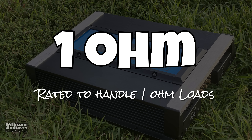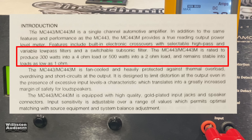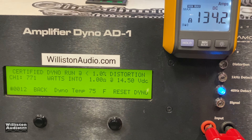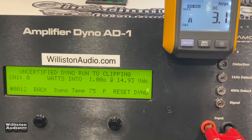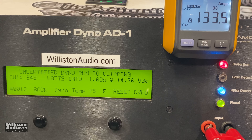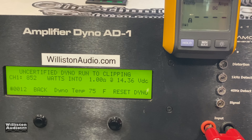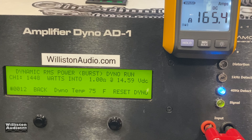I did some teasers and had some delays this week, so I decided to go ahead and do the 1-ohm test and show it to you now. The manual states it remains stable to loads as low as 1 ohm. Certified with power guard enabled: 771 watts at 14.5 volts — it actually dropped power a little bit versus the 1.3-ohm test. Uncertified up to clipping: 852 watts at 14.36 volts. The dynamic run shows the capability of the power supply — 40 Hz test: 1,448 watts. Very nice.